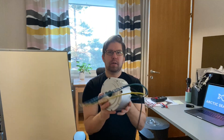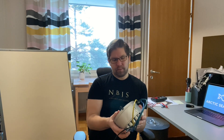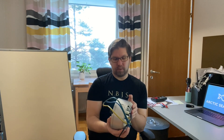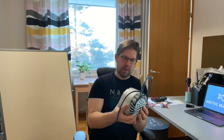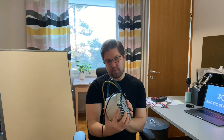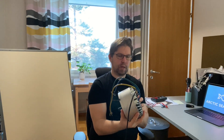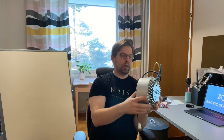We're on the lake side and the distances are not that long here, so just before Christmas I ordered this thing. This is a 3 kilowatt BLDC motor. It's a little on the lower side of power needed to push a 27-foot boat, but on the lake side there's not that nasty weather, waves, and things, so I think this will be plenty enough. It's manufactured by Golden Motor in China. I ordered it straight from the manufacturer but I'll put a link in the description to an Amazon store where you can get this. It feels very sturdy. The cables could be a little better but I think they'll work okay.